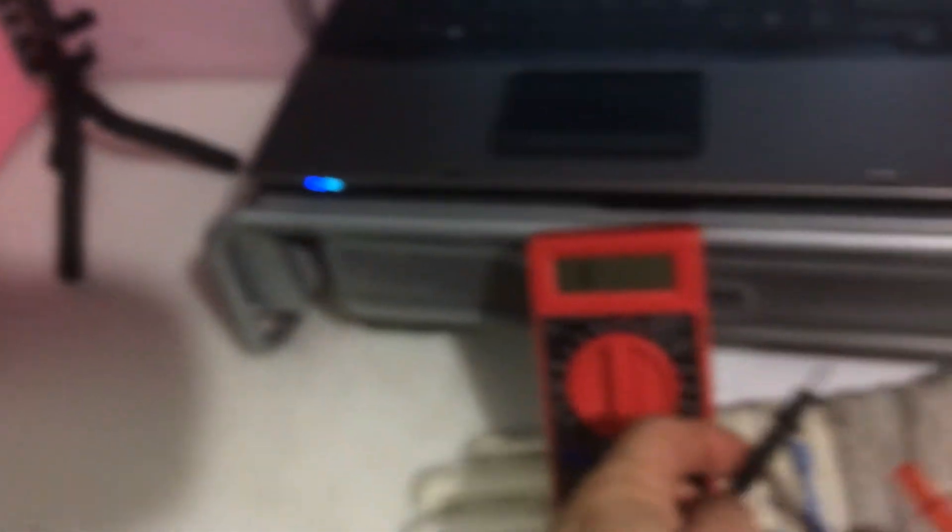Okay, so here we go. We have the meter, we have the glove, we have my probes. I'm going to touch one probe to the lame, then touch the other one — and there's the resistance. It's actually very good. Now I'm going to drag the probes this way, not with the pointy end in — cross like that — making sure there's continuity and I don't poke a hole in the lame material. Going with the meter — and it's going okay. And that's pretty good there.